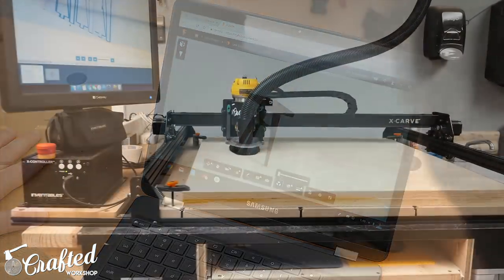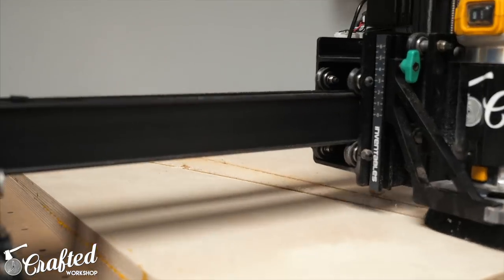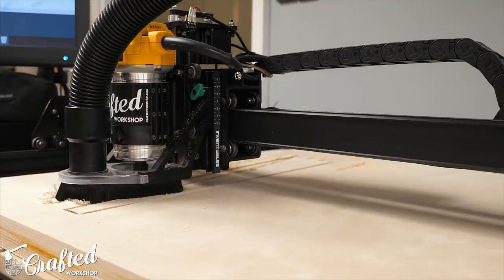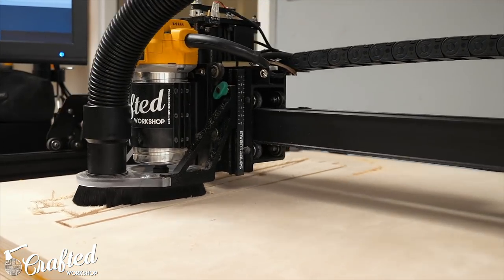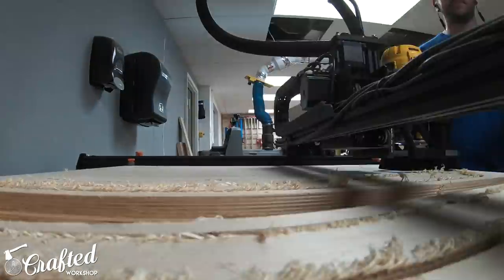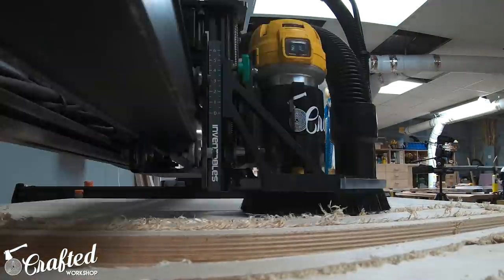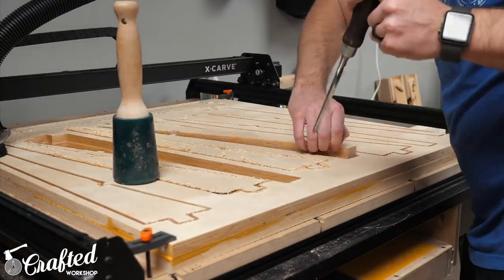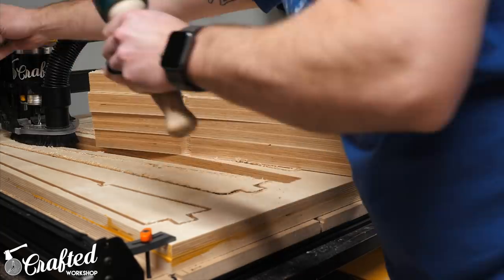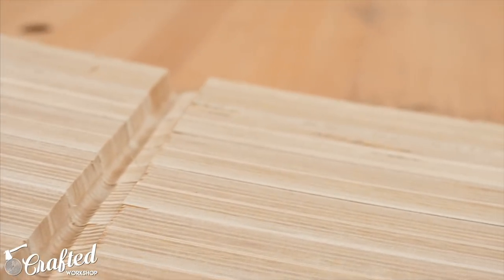On the first two legs we were getting a ton of tear-out on the edges of the plywood. After struggling through those, Evan found a setting in Fusion 360 that was set by default to run as a climb cut, which is the opposite direction you typically want when running a router on wood. After correcting that setting, the cut quality difference was night and day and the legs ended up with almost no tear-out. You can really see the difference in the legs in the foreground versus the legs in the background. Luckily there was enough extra space on the plywood that the couple of messed-up legs didn't force us to laminate another piece. The legs were amazingly clean right off the X-Carve — look at all those layers of plywood, so satisfying.